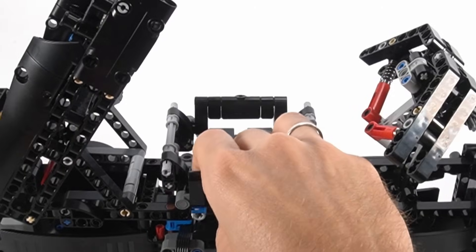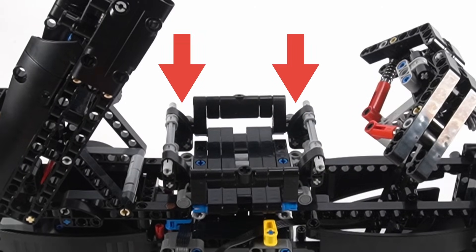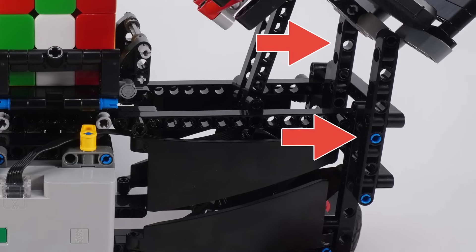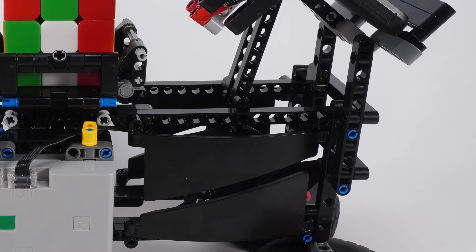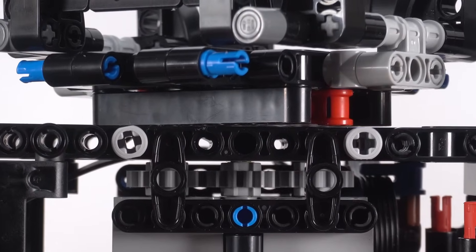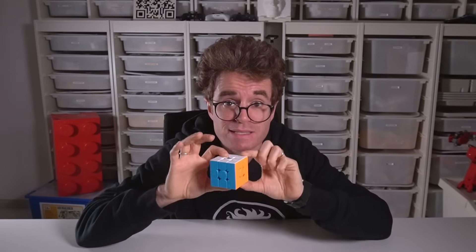Now let's talk about building the new robot using the unusual mix of parts from the LEGO Technic Audi 42160. It's funny to start with a car — something so different from the final result — and tinker with the pieces until I get a working machine. I repurposed the wheels as stable non-slip supports. The smooth curved pieces are perfect for guiding the cube and letting it slide neatly into position. The car suspensions became springs to hold the smartphone firmly in place. The flip-flop beams were super useful for building strong structures, and the slick bodywork panels let me add some style. To drive the arm I didn't have the right gears to boost the motor torque, so I used the differential with chunky yellow gears. And to rotate the platform — same problem — not enough torque to twist the cube faces, so I'm using two motors in parallel. The robot works best with speed cubes; I'll be using this original Rubik's speed cube with alignment magnets.